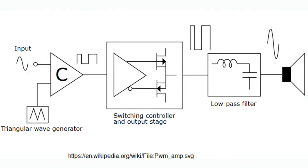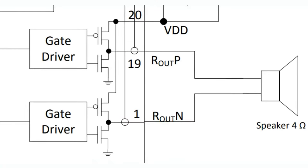On the Class D side, the speakers are heavy duty, a lot of wattage. By having a bridge tied load output, you can get, quote unquote, twice as much output to each side of the speaker, which is what lets you get to that 3 or 4 watt output. Class D is going to be more efficient when you're dealing with the high currents of speakers. With the bridge tied load, just be aware you can't connect this to a line level output to another speaker, because then you can't amplify again. It connects directly to the speaker. The speaker actually acts as the inductor that filters the high frequency PWM from the Class D amp. It's like 440 or 400 kilohertz, so it's like 20 times as high as the highest frequency. The inductor filters it out. It doesn't even respond to that high frequency.